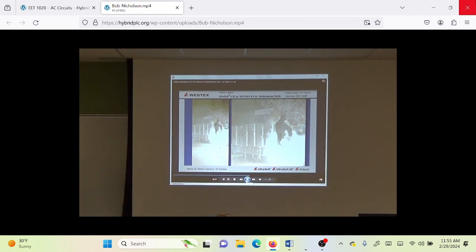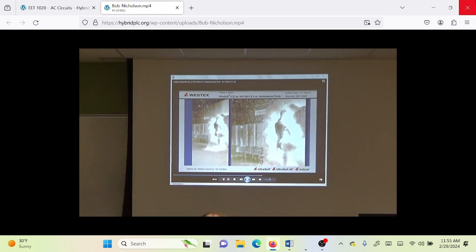now. Primarily a lower body event. That's copper and steel flying. An enormous amount of molten metal now is being thrown up in the air. It's going to land 20, 30, 40 feet. What you don't want to do is approach anybody when those panels are open, because if you don't have the protective clothing on, you're going to get it.